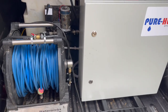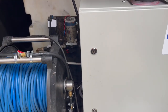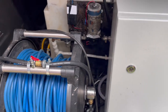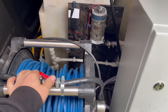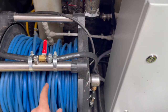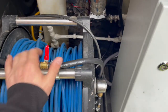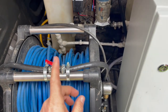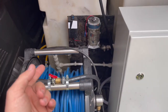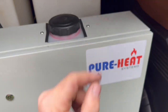So yeah. What you've got to understand about running a mixer valve with a setup like this is, as the water's recirculating, in between each job, so when I'm cleaning windows, I'm in the off position, so I'm getting all the water to my hose reel, okay? When I go back and I reel my hose up, I'm going to crack that open, and that's super important, not just because we want to be heating the water up in the tank. It's not even about that. It's about preserving your heater and preserving your battery.